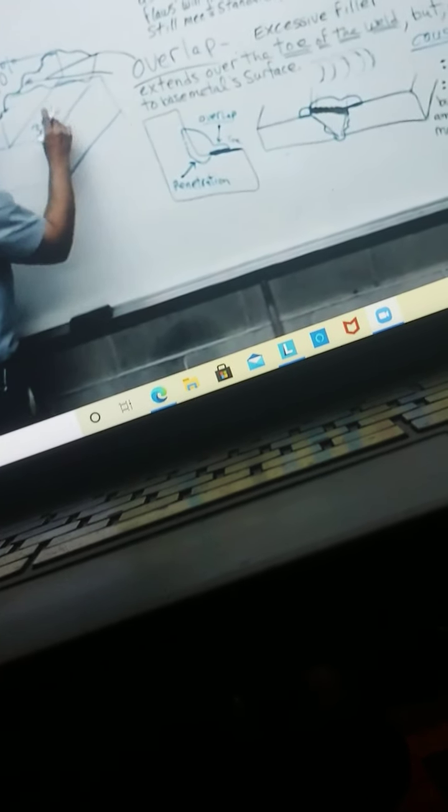What was your task? At the end, that's what they gave you, that you're looking for metal. We don't need this. That's for the torch, right here, for torch angle. Period. That means that you're disregarding the bottom. Why? Because you're saying 70% of your heat is on the top and 30% of your heat is on the bottom. It's supposed to be backwards. It's supposed to be the reverse of that: 30% on the top.